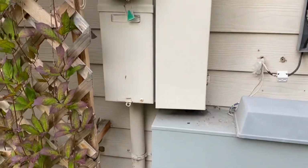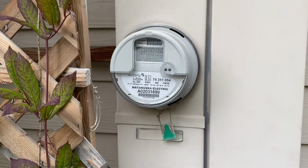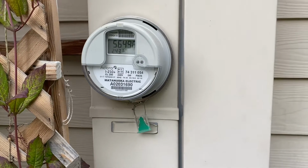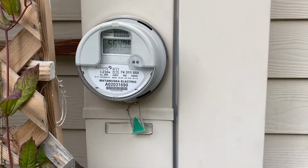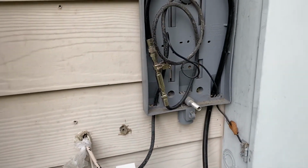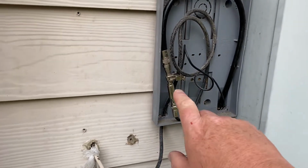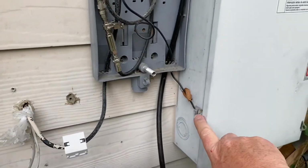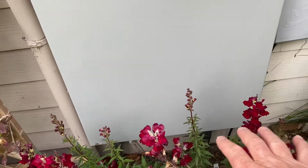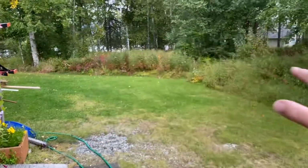Nothing's perfect, of course, and the reason is that they're using 50 or 60 hertz signaling. I actually pulse the 60 hertz from this little box here to send the status of what we're using on the power. Anyway, go back to the cable system, and the noise that you just heard is actually caused by them bonding their coax to this AC connection, which is connected back through to the mains isolation earth and de facto out to my earth system.